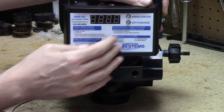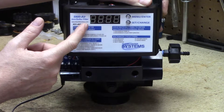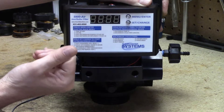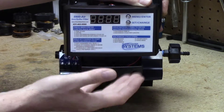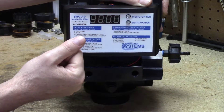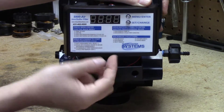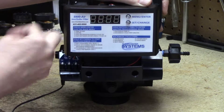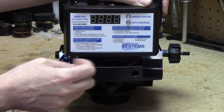Now we're going on to the cycle steps. Notice how it doesn't go to number one — it goes to number two. Step number one is not a programmable step; it's going to last for as long as it takes for the air to come out of the tank after remaining when it goes into the backwash — the previous air that was in there. So that's a sort of an air release cycle and it goes on for several minutes.